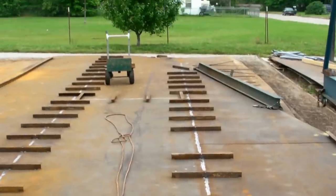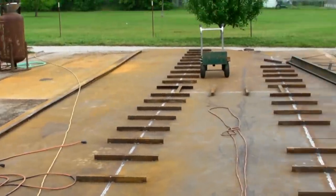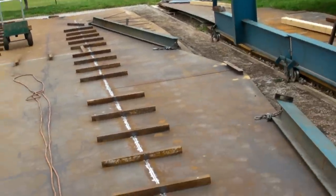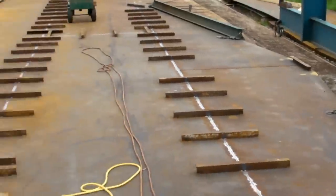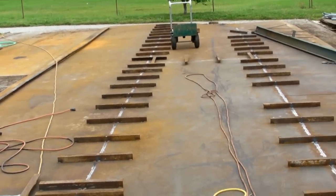Then we'll put welds on this side, turn it back over, gouge, surface grind where we need to, and put welds on the other side. This side is actually the side that ends up being rough because it's the interior of the boat, so we're not terribly concerned. That's why the Strong Backs are on this side — when we break them off we'll knock those welds down, but they don't have to be perfect. The welds are important though because it is the whole structural part — we don't want any holes in the boat.